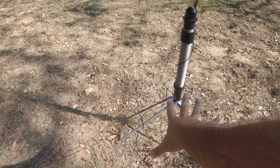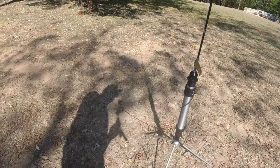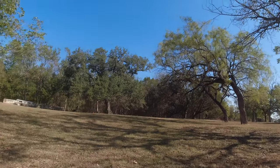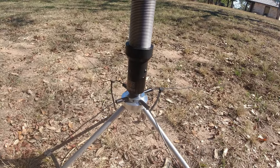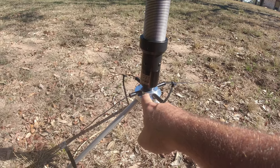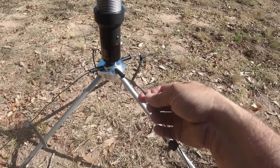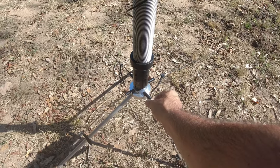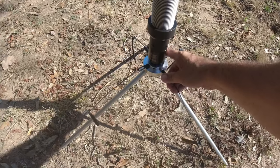One of the cool things about this antenna is it comes in multiple configurations. We've got a tripod and a ground spike over there. The ground spike is similar to those on several ground-loaded coil style antennas. You can buy it with the tripod or with the spike — you can buy both together, but the kit comes with one or the other. It comes with this puck attached to the bottom of the antenna. This puck has eight lugs on it and comes with four wires for ground radials going in four different directions. You can add more wires — they use banana plugs, so you can put them in anywhere you want. Really simple.